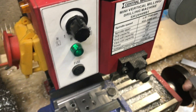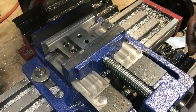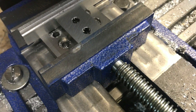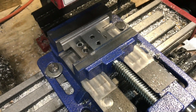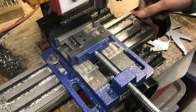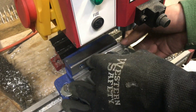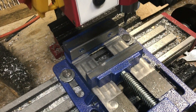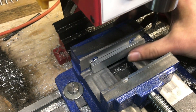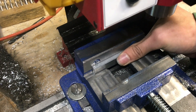The Harbor Freight mill is very nice, but the vise that I have on it right now is not very nice. You can see that I have done a little personal machining on this vise in an effort to get it more accurate. One of the current issues is that the vise has a little step down in here, and that makes it difficult to accurately clamp parts this way because they want to rotate a little in there.